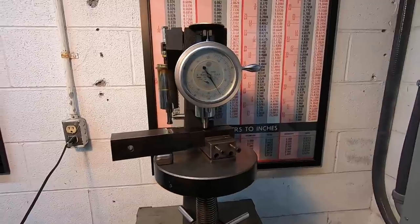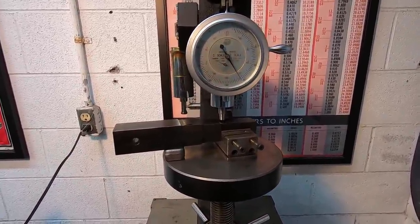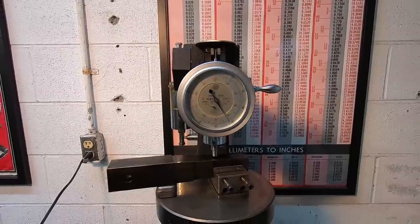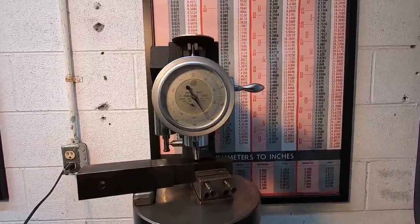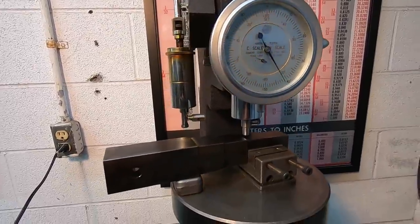After temper, I come back over to the tester. I wanted to see where it was finished at on our hardness, and to my surprise, it's showing harder now than it was before. So I don't know what's going on, if I've done something wrong, but I felt like I did the same exact thing earlier. But we're showing about 41.5 Rockwell C on that test right there.